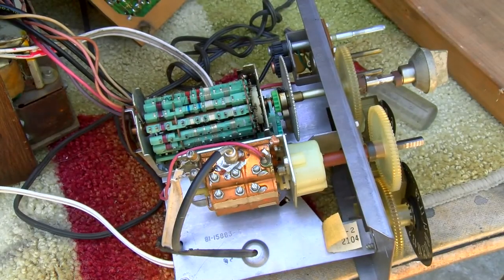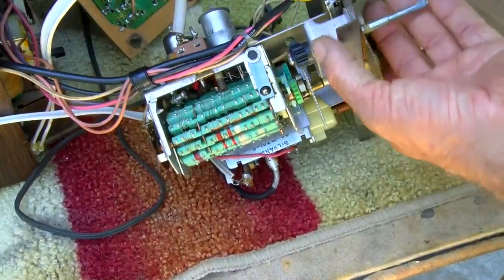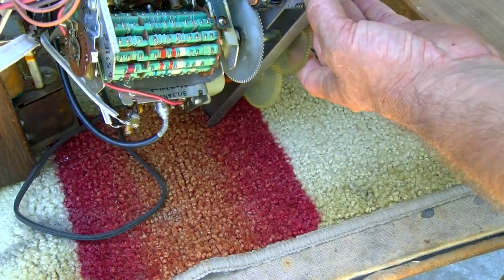I wonder why there's no activity, like the AGC is way off or the... I think maybe the tuner needs to just be cleaned. Basically, one screw and this whole thing comes out, and I'm just gonna lube this all up. I'm gonna do the pots here. I'm gonna do the volume control, get it in there. Give that a little squirt. Get this one here a little squirt.